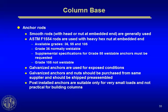We've actually had situations where we've had extremely high tension forces in anchor rods, and we've needed 4-inch diameter anchor rods where the grade 105 wasn't getting us there. And there is another ASTM number in the manual. I forget what it is, but it ends with a grade BD. It goes all the way up to like 150 KSI, F sub U. So in a 4-inch anchor rod like that, you can develop some serious tension. So if you outgrow 105, there is another option available to you, but obviously they're very expensive. And to try to transfer the force from a 4-inch 150 KSI anchor rod down into the foundation takes some foundation too. It's how you develop that force down into the pier, but it can be done.